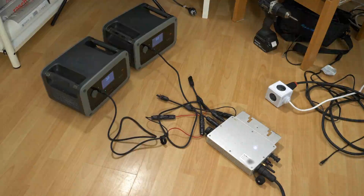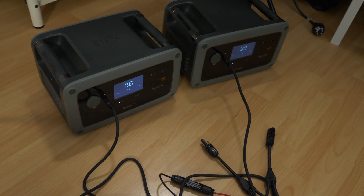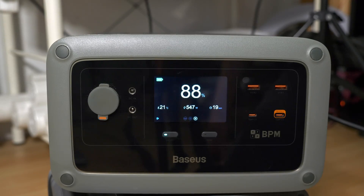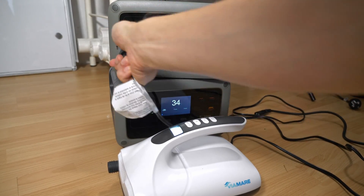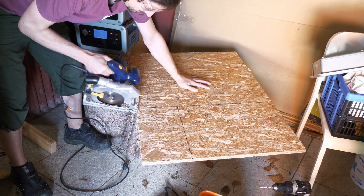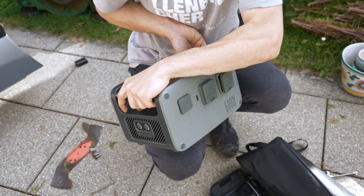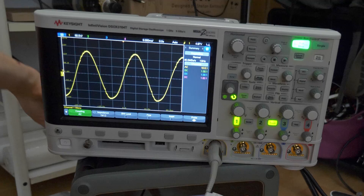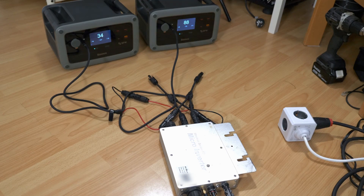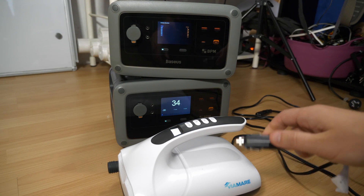Even though it's cool that it works, I doubt these DC jacks are made for a permanent 10A load. The noise level is moderate at high load. So what's my conclusion? It's a nice compact battery with the possibility to daisy chain for more current. One battery covers typical camping needs; two batteries start outputting useful power for some tools. However, to run things like circular saws and other inductive loads you'd need more than 1200 watts. If size and weight matter while being able to scale on demand, this system is certainly an option. The DC output is smooth but has no UPS or backup mode yet, and the recharging options are impressively vast. I'll be using it for gardening with the battery backpack and for camping to power my cooler or paddle boat pump.